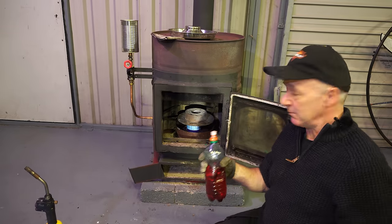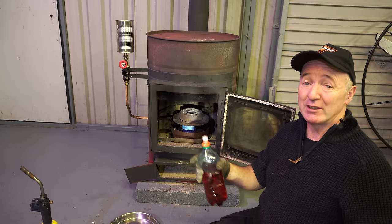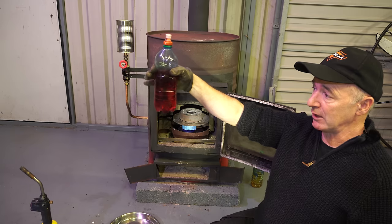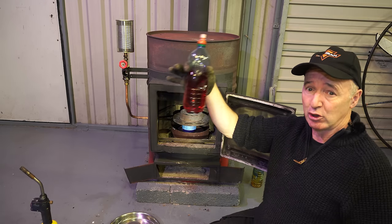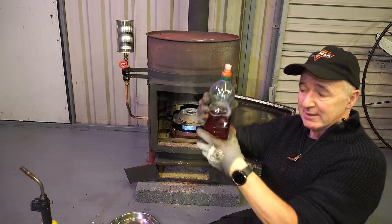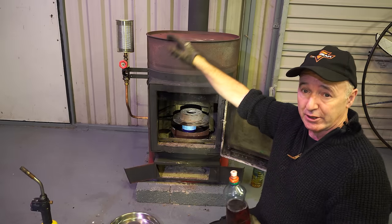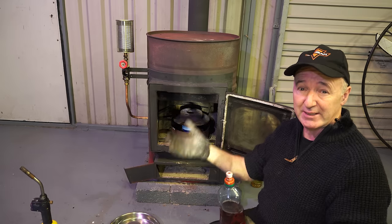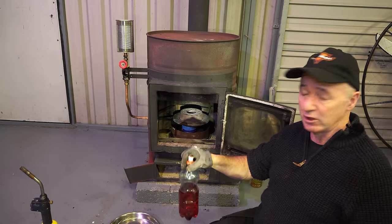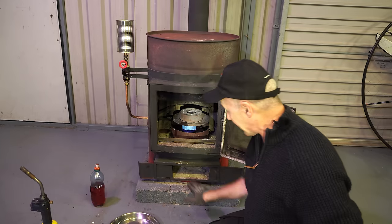This is really quick and easy — it makes an absolute ton of heat, more heat than most people would need. This shed is one layer of sheet steel, so I have to make a lot of heat. This is kerosene — it could be diesel, no problem — and I'm going to squirt a bit in. The idea is this thing gets it going, gets it red hot, and then as we drop vegetable oil into it, it vaporizes on its way in and burns. Cold veggie oil or cold engine oil won't burn on its own.